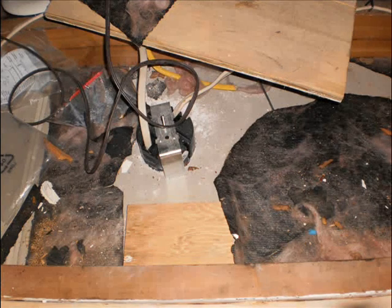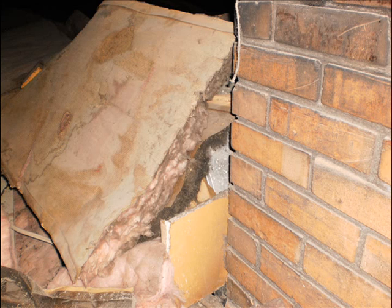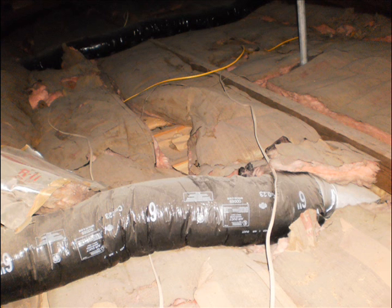There are places with no insulation at all. Here's an example of a batt showing signs of condensation — you can see the stains — and this is just loosely draped over a heat duct up in the ceiling. There's no air sealing around the chimney, just all sorts of problems. Here's another poorly insulated and air-sealed piece of ductwork, and this patch where there's no insulation whatsoever.